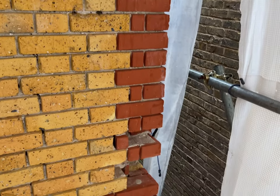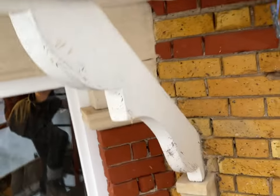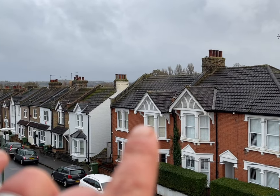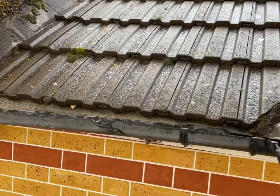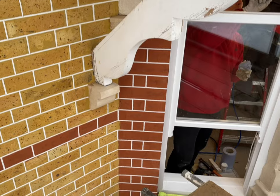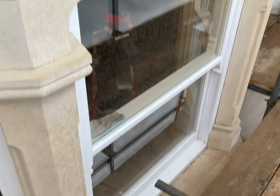There are more new bricks to go in all down the corner of the building and upstairs. What we're doing on the top elevation is taking all the pebble dash off the gable, then we're going to be smooth rendering the gable and then recreating the stone band feature like the houses down this street have, to replicate that for the customer — a nice smooth render with nice stone band features. We're also decorating all the woodwork and changing the guttering. The tuck pointing looks absolutely fantastic, a really really nice finish, and nice new sash windows have gone in.